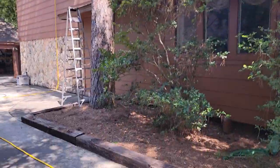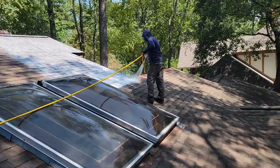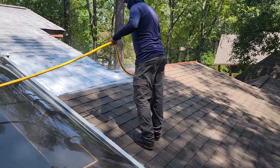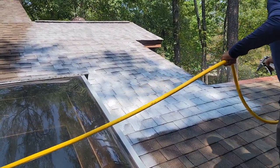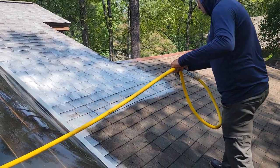I'm going to get up on the roof just so you can see. The reason I'm pointing that out is because our competitors will say that they do a 50-50 mix, which means they're putting far more oil on it. But when they get their concentrated mix, it's actually already diluted — it's white, diluted by 50%. And then they tell their guys to further dilute the product. When you're spraying on a roof, this is the way the product looks: milky white, clears or dries clear, puts the pliability back in the shingles.